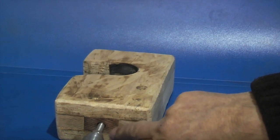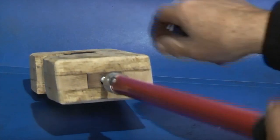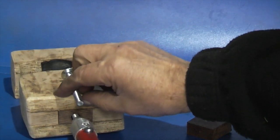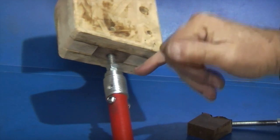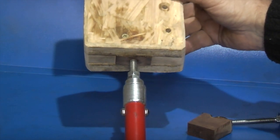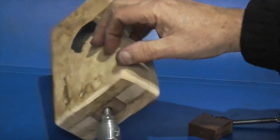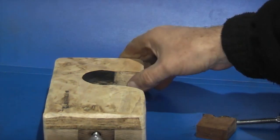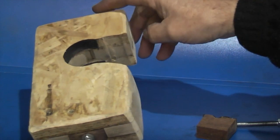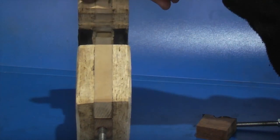In the bottom of the channel I've put a block of wood with a hole through so that bolt can go in. This is just a coach bolt fitted to this rod. I've put two nuts to lock it, so when I turn the rod it doesn't unscrew the coach bolt out of the end of the rod. To stop this piece of wood moving in and out, I've just put a screw through there and a screw on the other side. When I fixed these pieces of wood together, I used a hole saw to cut a hole the diameter of the pipe I'm using from each side. It's important that the centre parts are clear so it's only the two pieces of wood each side that touch the tube at the top.